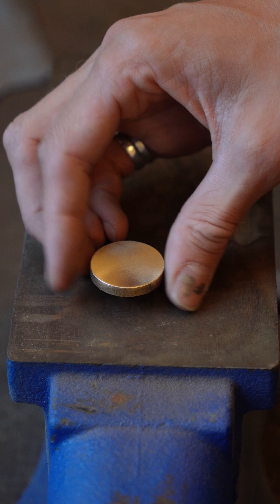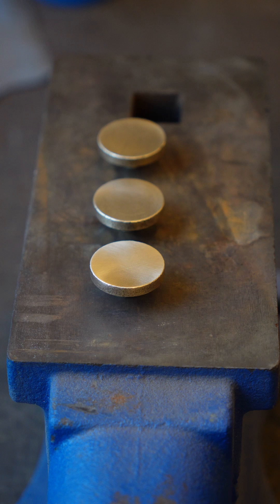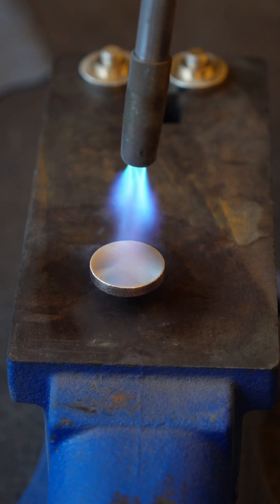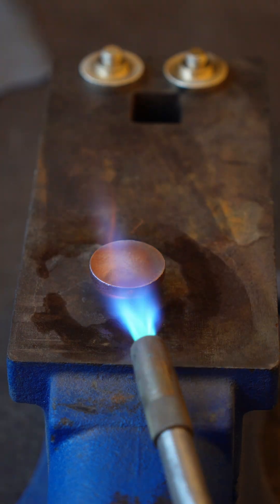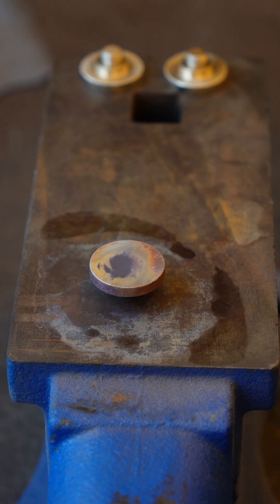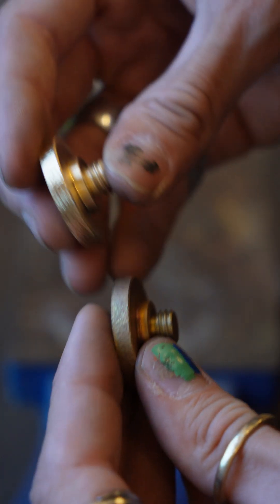All the brass and bronze pieces on this project — the customer wants them to look old. There are a few different ways to do that but I'm going to try using heat. I've done this before and it just accelerates the oxidation on the brass and it should end up quite an even brown colour. You need to get it pretty hot so I'm going to do this until it's glowing. And that's the result — I think that looks really good compared to how it was before.